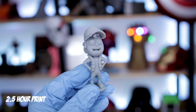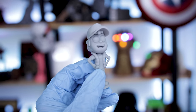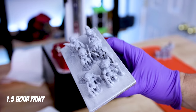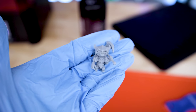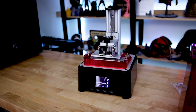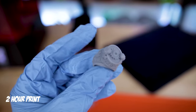Here is one of the other characters from Gravity Falls. This was one of the prints that printed properly while the others completely failed on the build plate. But this guy right here turned out really fantastic — able to get all the supports cleaned up, washed off, and cured under UV light. I also printed a whole build plate full of little goblins. For such a small machine with a lower resolution screen compared to the Elegoo Mars or Anycubic Photon, I'm still getting some really fantastic prints. One of their test files — some rings — is where I encountered my first fail, likely due to the build plate not being properly leveled.